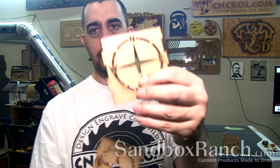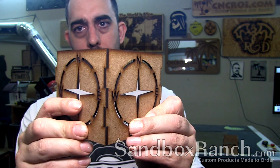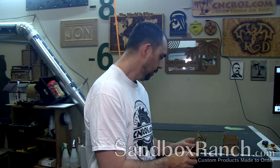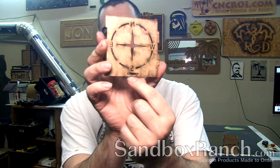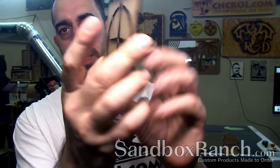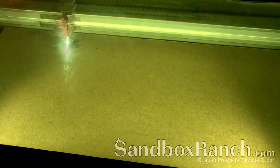Anyways, the way it works is every panel is identical like this here, and they just interlock like this to form a complete box. And that's the genius that David had, because when I saw that, I go, that's a really quick design, because what it means is that you can customize whatever you want on the face here, and it'll work perfectly. Everything just fits perfectly. Now, you also have a base that fits into here as well. This is the back side of it. This is the front. So the base fits in here and it holds everything together. You just put a little bit of glue, and you have basically a finished box.